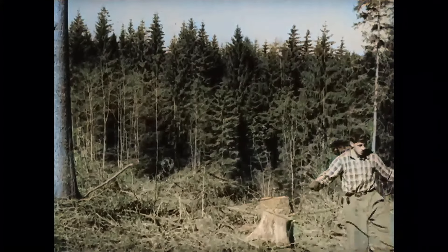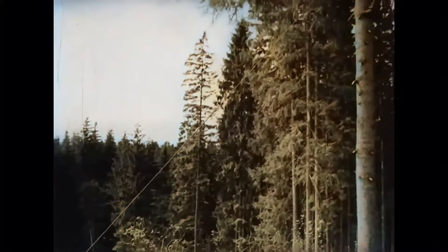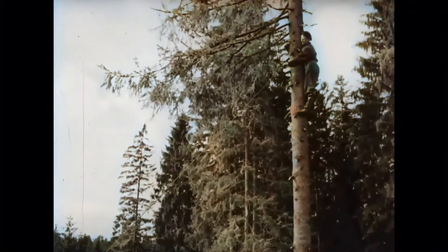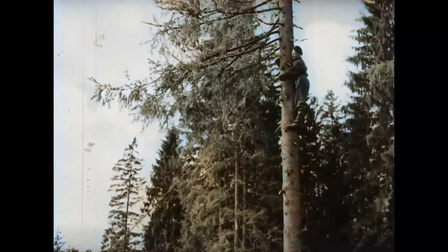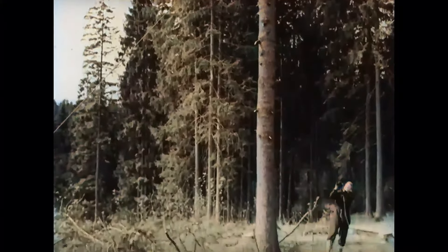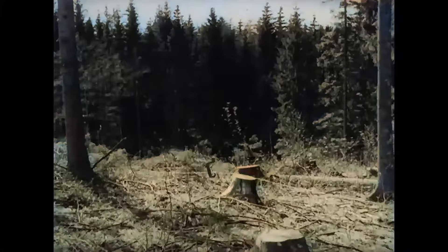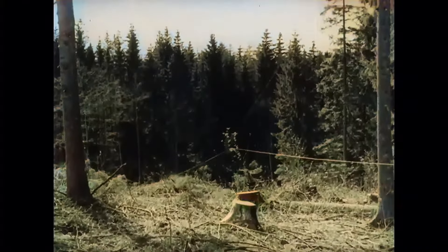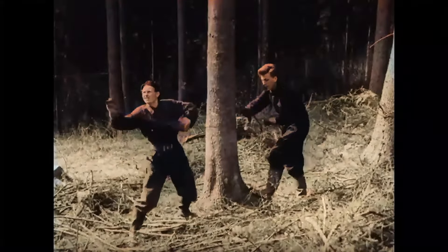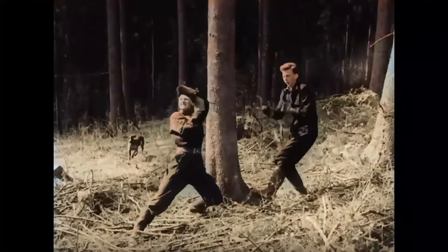While this is ongoing, the strapper and signaler mount the hanging supports. A cross-line is fastened in the terrain, led up into one support tree, threaded through the carrier shoe, led through a suspension bracket in the other tree, and can now lift the carrier cable into place. The mounting is secure and fast because the heavy work is done on the ground.